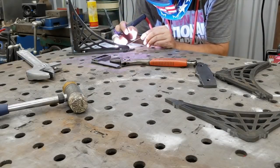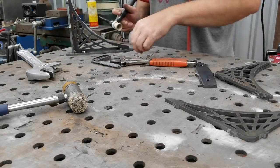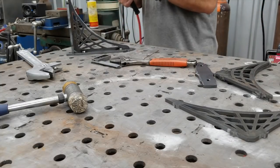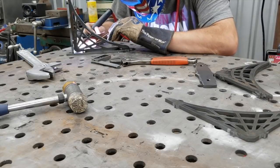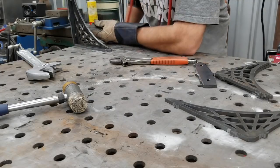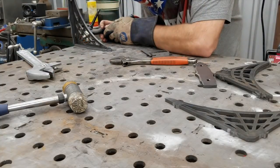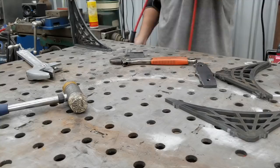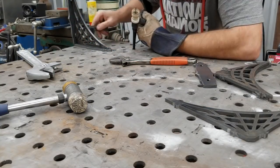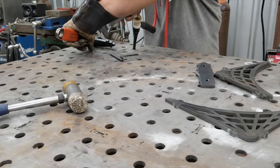Eco Mouse Design worked with me on these, maybe about a year and a half ago. We were trying to do a tab and slot design so they locked into place, and they do lock into place — it helps you locate it. But the problem is that the quarter inch hot rolled steel has just enough of a draft on the edge that keeps it from sitting level, so you can't just fit it up and plug weld it from the backside on the tab and slot.